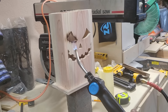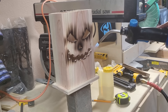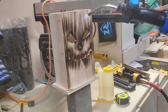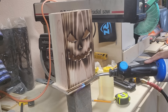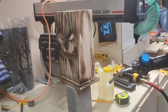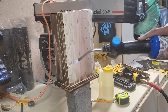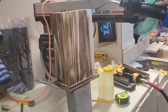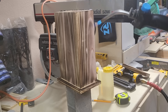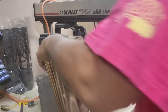Once everything is assembled, it's time to apply the finish. I used my torch and burned the outside of the box to give it that rustic look — I have a whole video dedicated to this technique and I'll link it in the description. I also burned the inside of the cutouts, which had the unintended but very welcome consequence of giving a darker burn around the cutouts on the outside face, creating a cool ominous effect once stained — perfect for the Halloween theme. Just be careful not to overdo it since cedar is soft and burns easily. Keep a damp cloth on hand to put out any small embers before they burn too much.